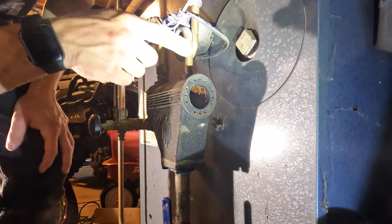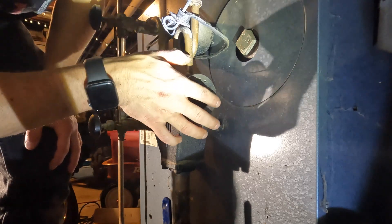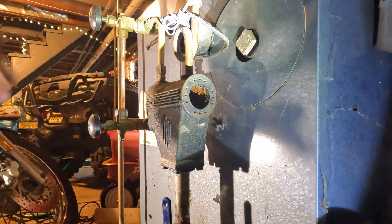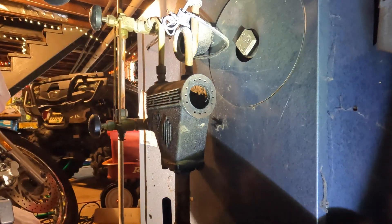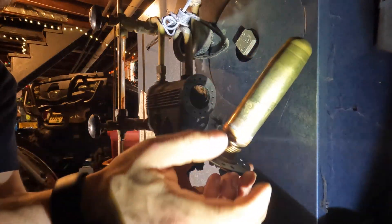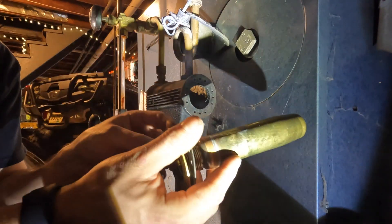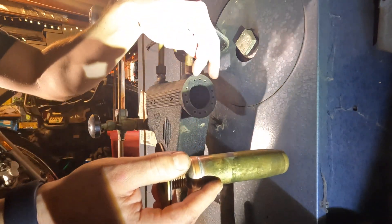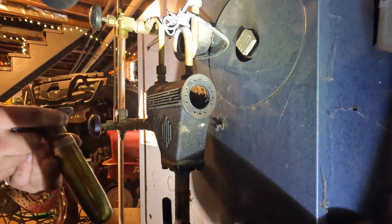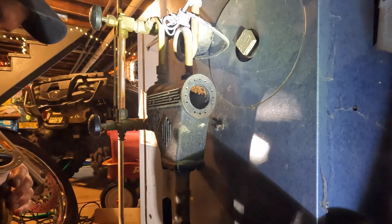I got this super clean — there's still some residue from the old gasket but I sanded it flat. You could go more aggressive, though I'm being paranoid since it could be asbestos. Here we have the new float with the gasket already on it, so we just slide it right in. It takes four screws — two on top, two on the bottom — to mount it.